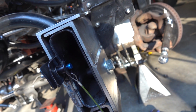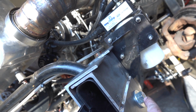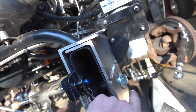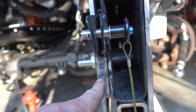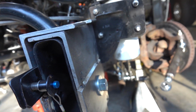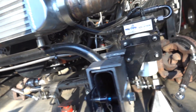We'll have a bolt on the inside here. We'll do it on the back side of the frame. We're gonna do at least another bolt here and probably another bolt up here. Also have a spacer here so we're not smushing our hinge. So very happy with it so far. I'll take the bolt out and show you just how easy it is to put on and off.